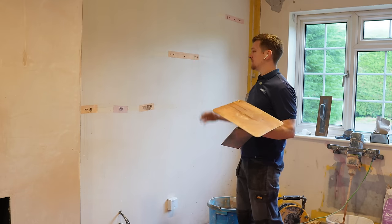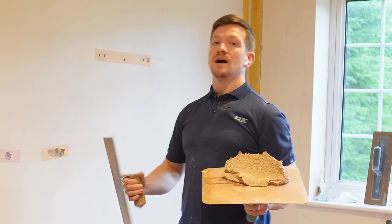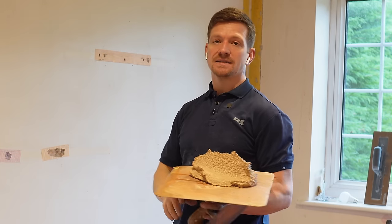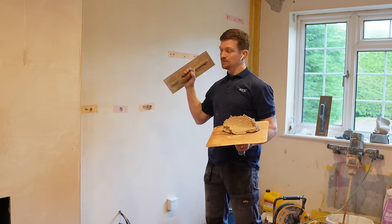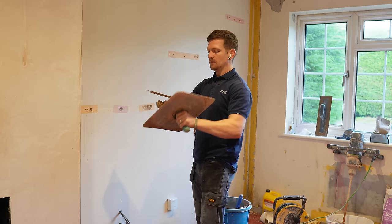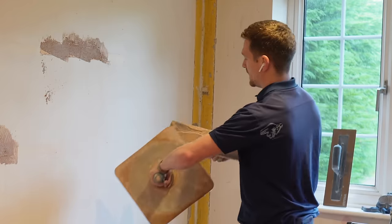Now it's time to rebuild. We've caused damage, we've prepped the walls — now it's time to put it all back together. Bonding is the perfect all-round undercoat. It's great for filling holes, working back onto masonry, filling craters, cracks, or anywhere close to brick. The only time you won't use bonding is if you're starting a wall from scratch and floating and setting. But for anything else, bonding is amazing — we're going to fill all these holes and make it look pretty.